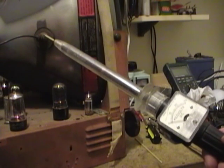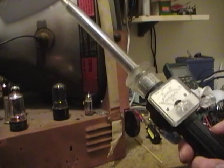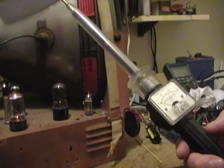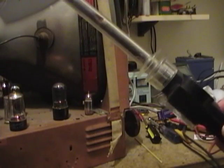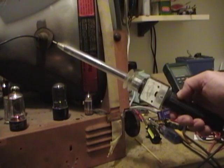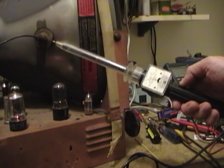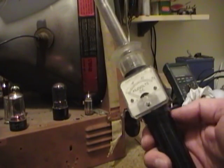This also gives me a chance to try out this high voltage probe a friend dropped off yesterday. It's a Pomona, just like the one I've been using, although it's a slightly older model. The problem with mine is that it seems to be off by about 30% — reading a lower voltage than it should — and I don't see any obvious way to calibrate it. The resistors inside here may have drifted off value and it's more practical to try getting a new probe than to try repairing it. At any rate, with this one I get 13,000 volts, while my other meter shows about 11,000. It's supposed to be 14,000 according to the specs. I trust it's about 14 because we're getting a nice bright picture, so I think this probe is more accurate than my other one.